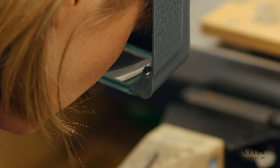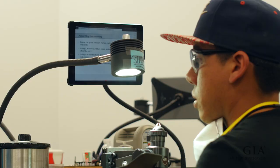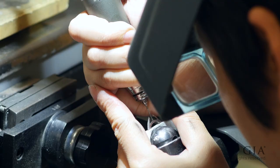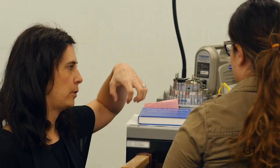We use our 0.90 round burr — that's the one we cleaned in the ultrasonic — to make a little dimple. Then we'll use our 1.0 twist drill, drill nice and straight down through there, and then we're going to open that up just a little bit with our 2.3 round burr to open that drill hole up just a little bit.